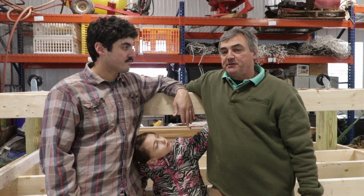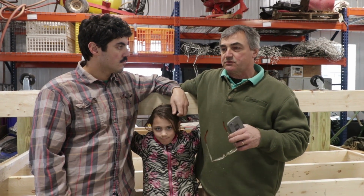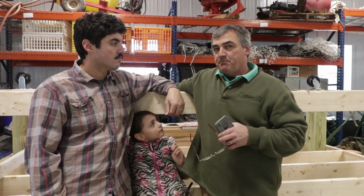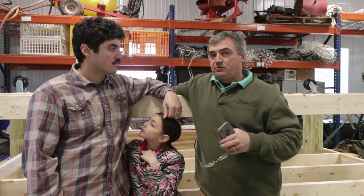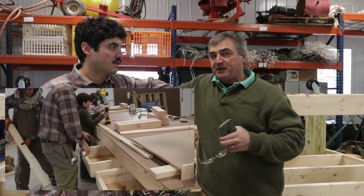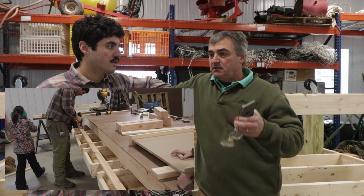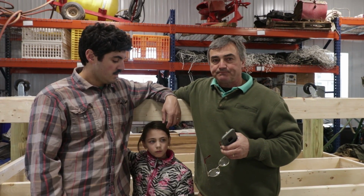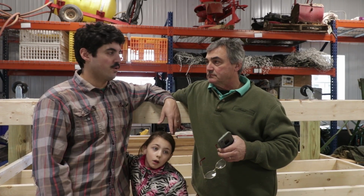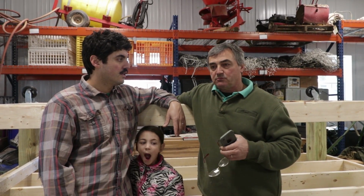And the drawers, we're gonna build out of heavy lumber because the drawers will serve 2 purposes. They're gonna store tools and screws and nails and all this sort of thing. But they're also gonna be an extra little shelf that you can pull out and put some lumber on and cut off of them. So they're super strong. It gives you an extra little space if you need it, just temporarily. You can whip out a couple of drawers, throw a 4x4 on it, cut it, then push the drawers back in, and not have to go somewhere else and set up. They're like an extra sawhorse. Yeah. You can just pull out and work off of. When they're done, we'll show you what that looks like with some wood on it.